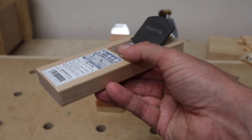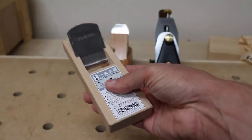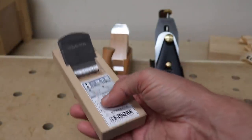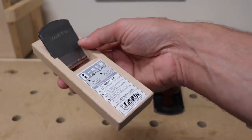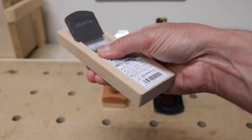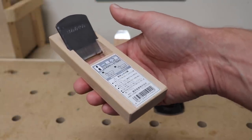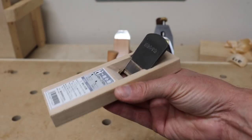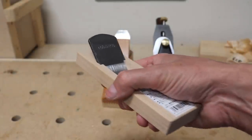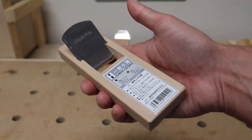Learning to adjust these and use the plane hammer with a little finesse will get you excellent results, but it takes practice. If you're not used to the pull action of Japanese hand planes it will take a little longer to get the hang of it. The principle applies to all wooden hand planes: you never force the action. The plane should pretty much effortlessly pull that shaving off in one smooth motion — with the pull action that's tricky at first, but when you get used to it, it makes total sense.